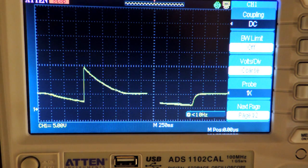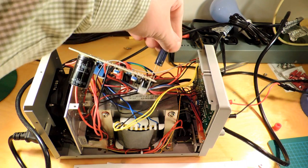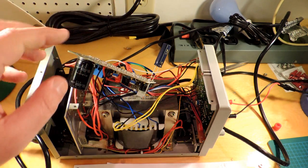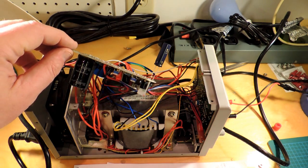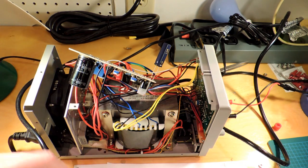The question is, can this be fixed? And the short answer is yes. The power supply is opened up here. This is the main control board. You can see there's a capacitor tacked on the back — this actually solves the problem. A little more capacitance on the rail results in a much more stable supply where it doesn't glitch up on power transients. Let's take a look at the schematic and see why this fixes the problem.